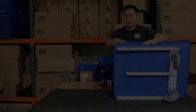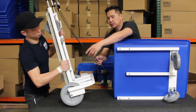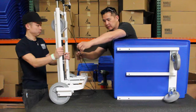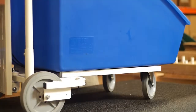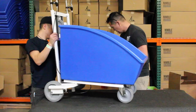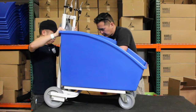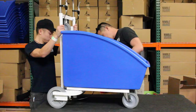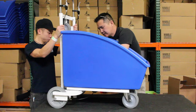For the next step, bring the rest of the frame into place — the part you assembled in the previous steps. Make sure the two wires and two brake cables are kept loose and not kinked. Tilt the frame upright and line up the holes on the frame. Put a washer on the longer bolts and run them through the top. Having a helper here is useful. The casters were loose-fitted so you can make adjustments if needed, then put the nuts on. Don't start tightening anything down until everything is loose-fitted first.